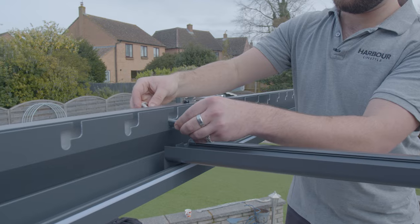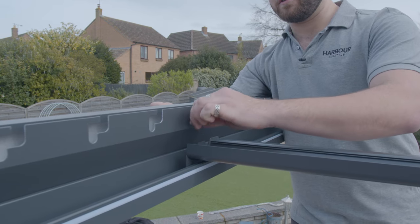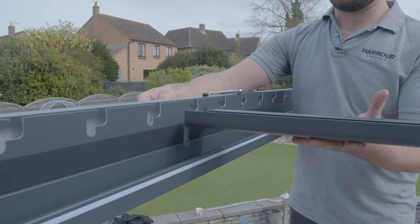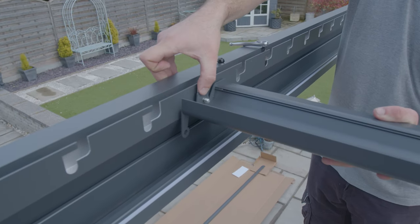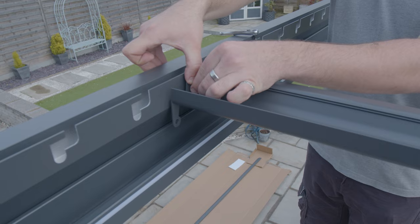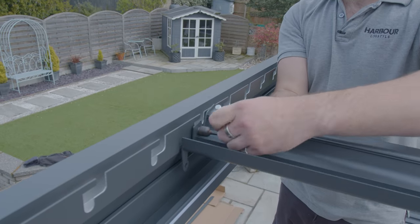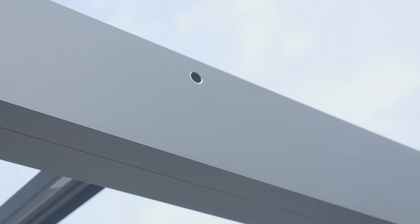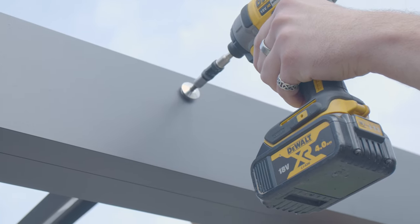You want to slide that piece through the hole, and then this silver piece will fit in the hole on the outside — we can just thread those back into each other until it's finger tight. Give it a little push just to make sure it's on there. We can then lift this louver up — it's just been resting on the gutter — and slide the pin back into it, making sure that that square hole goes over the peg. We can then reinstall the nut and washer to tighten it all up. To finish it off we'll take the other silver piece which we put in our pocket earlier — easier to do this on the impact driver. Put it in that hole, make sure that it goes onto the thread that's already in there, and just tighten that up. And that is the centre louver completed.